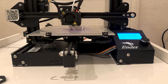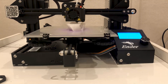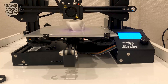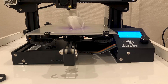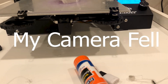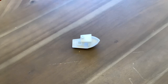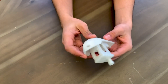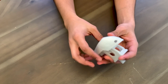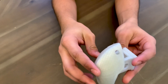I left supports on — I know my 3D printer works, so I'm printing this to test the glow, not really as a 3D printer stress test. Right around here I did have a slight layer shift, but it's not anything too big. Just like the skull, the quality is really good, but one thing I noticed is I can see the infill, so I'm probably going to turn up my wall line count for the third print.